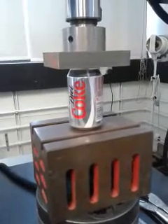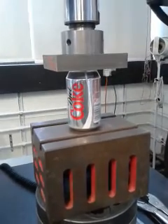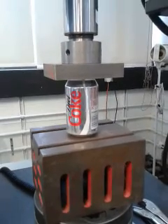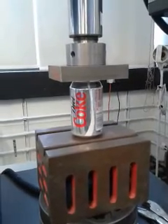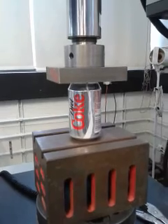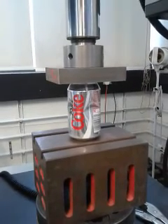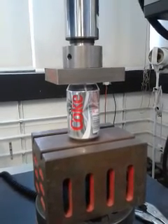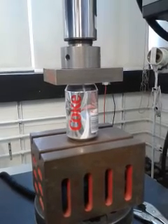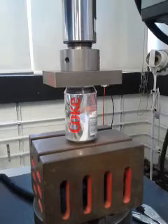When it's at 0.5 millimetres, I'm going to just run it down slowly. One millimetre. So the maximum load on there was 650 newtons. Now it's starting to collapse it — one millimetre travelled, there's only 395 newtons.